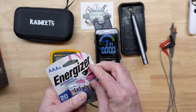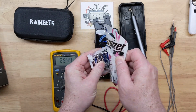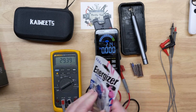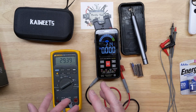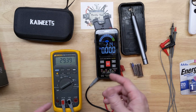These batteries are 1200 milliamp-hours, and at 30 milliamps that works out to about 40 hours of use on this meter. With the 15-minute auto power-off, we could roughly say 160 uses — that's pretty impressive.